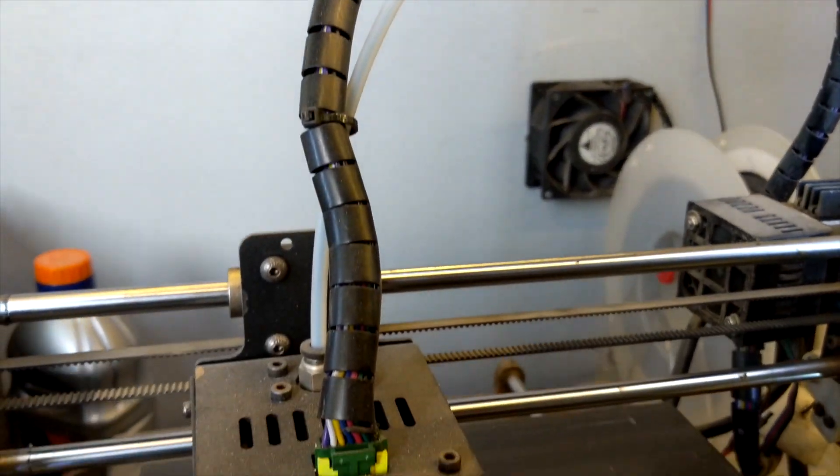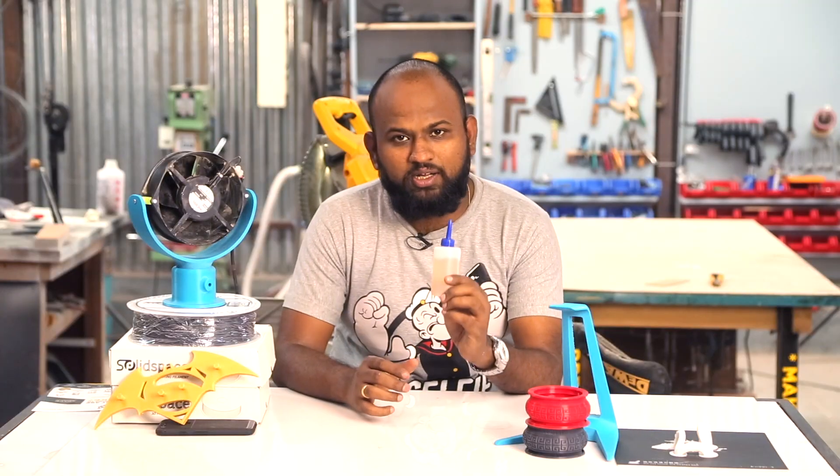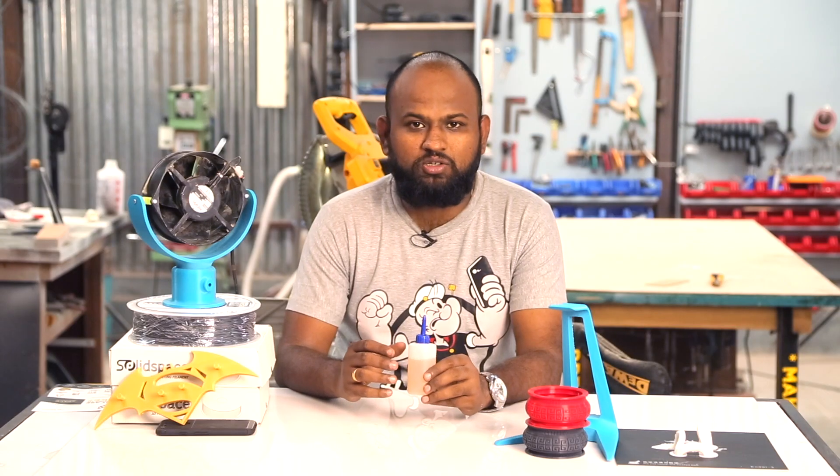The fourth point is clogging. Most of the time this is not the printer's fault but ours. Clogging can happen if the filament is dusty, the temperature is not right, or there is insufficient lubrication inside the PTFE tube. When PTFE tubes are new they are soft and allow easy flow, but printing with PLA over time creates a rough surface. I always use a sponge to push the filament through and lubricate it with a special thin oil that does not burn with heat. Just one drop is sufficient for half a roll and it does not affect the print — in fact, it greatly improves under-extrusion problems. This oil works with all types of filaments.